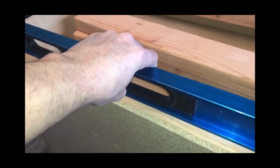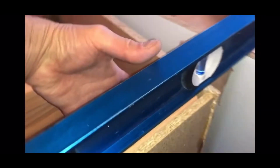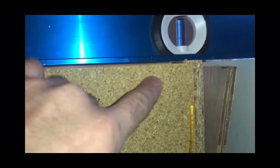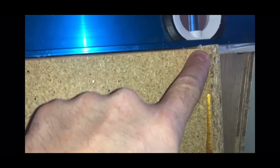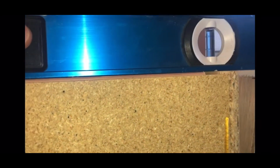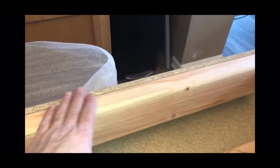Using a nail gun. So what I did is I used the glue gun over here. I took my level to make sure that everything is level. And then I lifted this up so that it's level to the highest point. You can see this one, they're never perfect, so I got almost a 1/4 inch gap right there. So the highest point, which would be those sidewalls, and I lifted it up, and then I shot a nail gun into it about probably like 15 times. So now this is well supported.